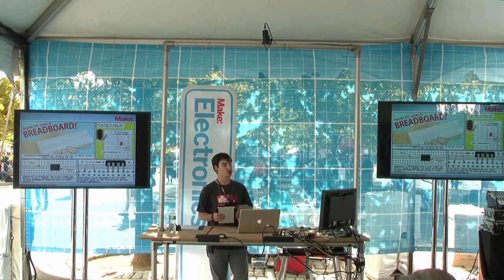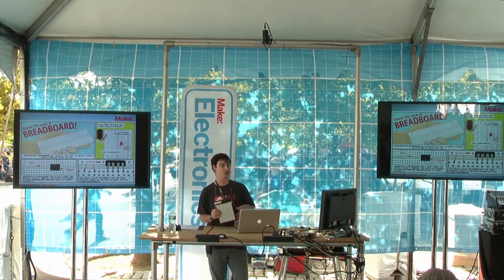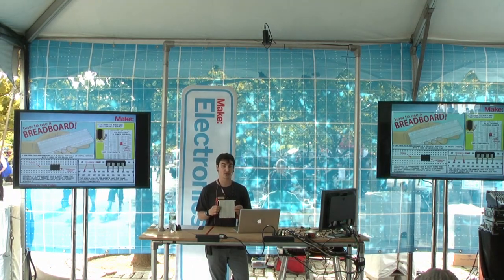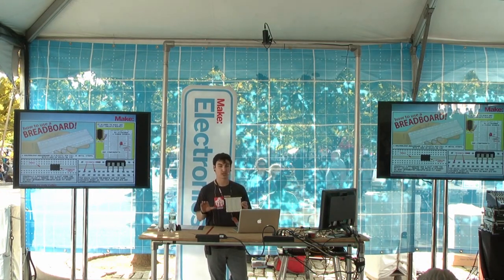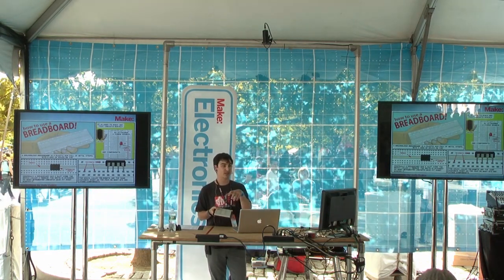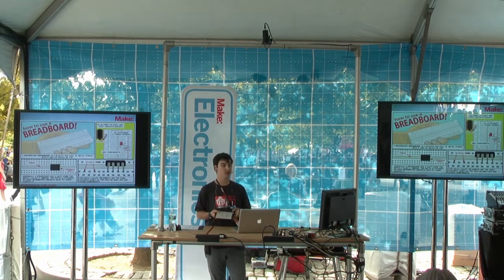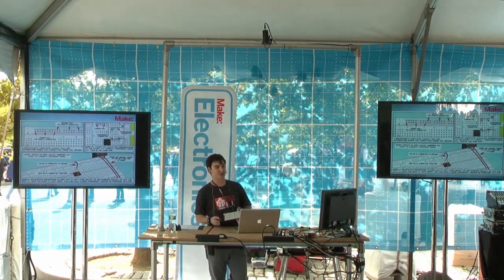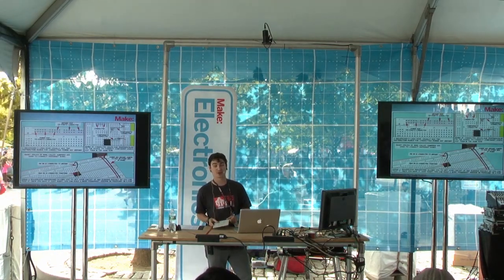Once you've got that taken care of, you can start to do some things with integrated circuits, microchips and so on. You'll see in the illustration that there are deep ridges — trenches — and those are physical separations. The left-hand side of the board and the right-hand side are physically separated by that trench, so there are no connections, no contacts. What that allows you to do is put a chip — as in the bottom left corner — that straddles the trench, so all of those pins are on their own separate nodes with no electrical connection between them. There's the grounding bus, the tie points, and the power bus — and in the top right corner the grayed-out area, those are all connected together.